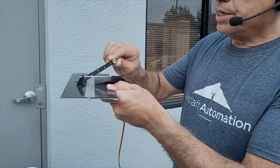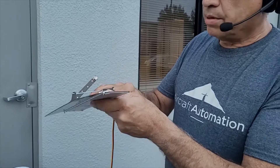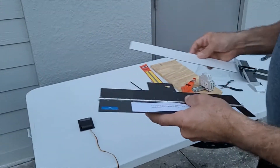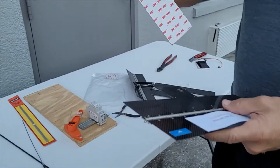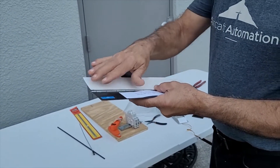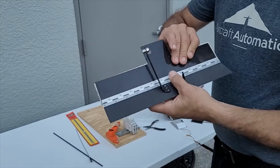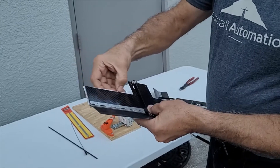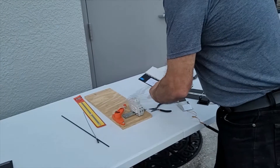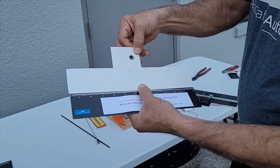It works really good. After the servo is adhered to the carbon fiber trim tab, it works really nicely. Some people will want to rivet it, but I would say adhering it to the trim tab is enough with the double-sided tape. Now we take the rest of the 3M tape and we want to adhere it first to the carbon fiber trim tab. We cut the excessive tape and stick it together so that it coincides with the cable hole.